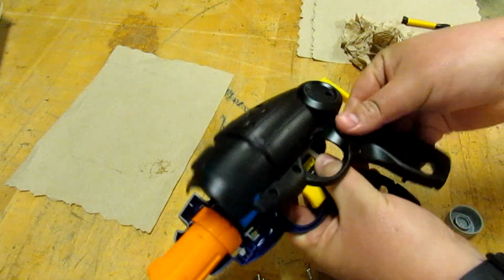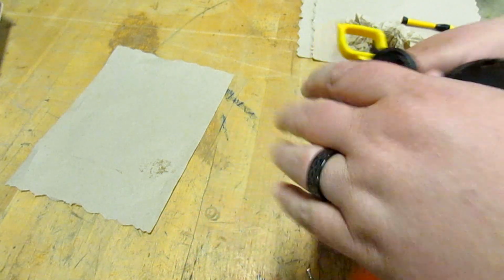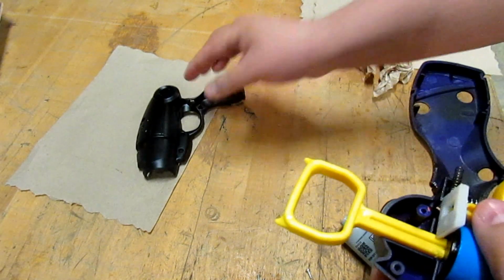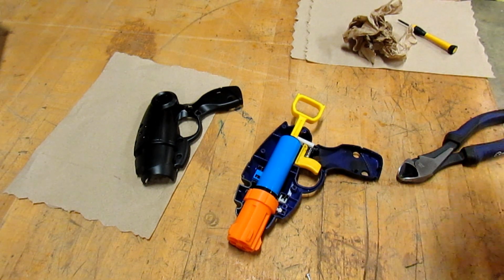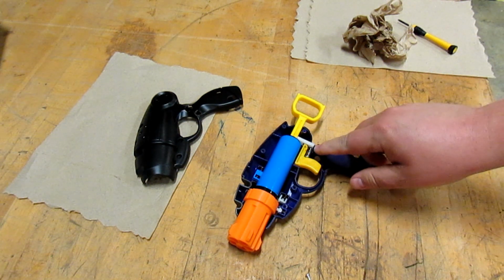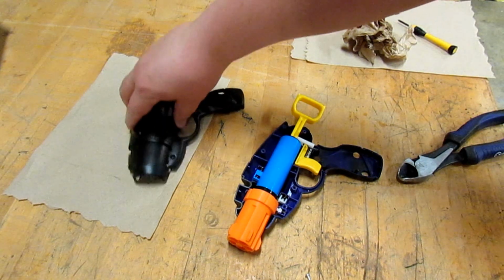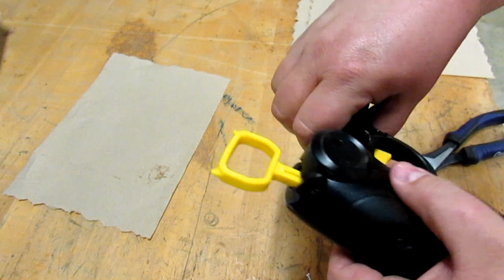This may be easier said than done with that plunger catch behaving like it is. Yep, just as I suspected. Okay, finally back and ready to button everything up. I had to trim down the trigger spring to match the length of the catch spring so that we'd be good to go. It kept wanting to bend out of the way on things.